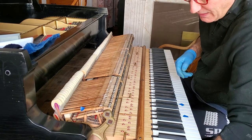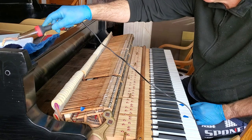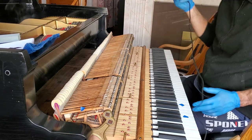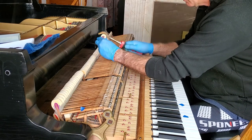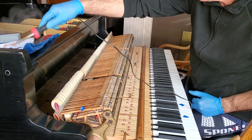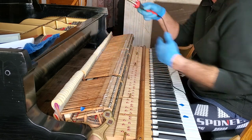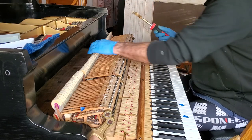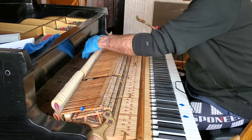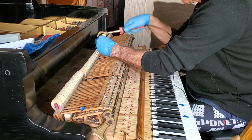This is the iron, and I have to cool it a little bit on a wet piece of cloth, otherwise it will scorch the heads. What this does is essentially iron with heat and a little moisture from that cloth — the very head — in the same way that you iron clothing. It puts a little sheen. If you do not cool it with the water on the cloth like I'm doing, then you will scorch the heads of your hammers.